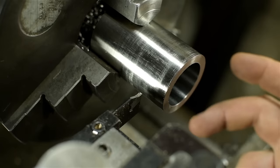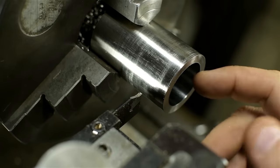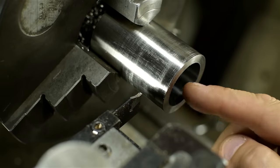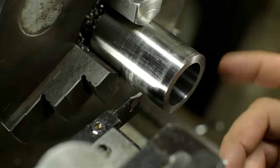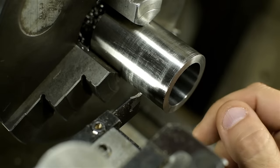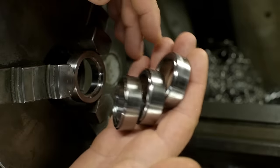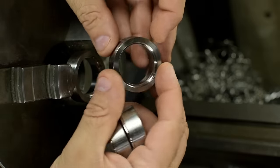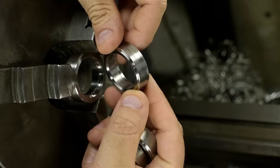It's four or five times more setup, but I think the odds of getting a good threaded part are much higher. The other downside is I'll be taking this work and putting it back in the chuck four or five times — the threads I cut might not be on the same axis that the part is bored to. But luckily, this is a gas cap, so as long as those threads pull the seal closed, it shouldn't really matter. I took the opportunity to size the blanks I cut off, cut them all to length, and cut recesses in each end — one for the O-ring, and one for the locating shoulder. Now it's time to cut the threads.